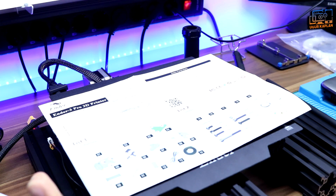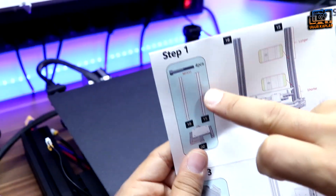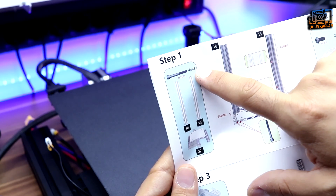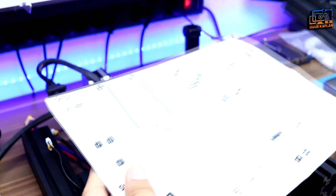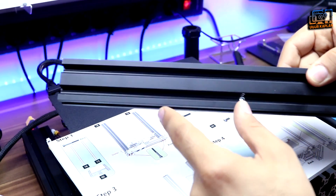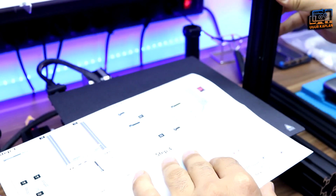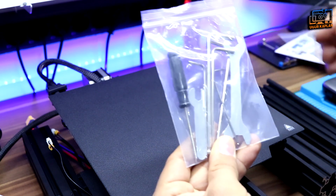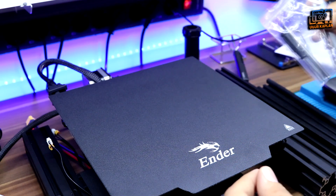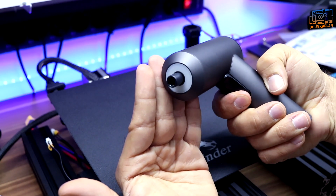As I researched, many people get confused about which screw to use. For instance, to fix the two profiles you need 4 pieces of M5 x 45mm screws, but 5 pieces come in the box — one is spare, which confuses people. Also, on the sigma profile, the longest length from the tip to the screw hole must face upwards. I'll use my rechargeable screwdriver set to speed things up.